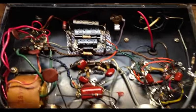Well, as happens so often whenever you're designing a one-off like this, I tested this thing out briefly and noticed that when I cranked the volume, I was getting some treble spikes on the output, just unnatural sounding spikiness. So what I've done is I've come in here and put in what's called a Zobel network here. And this is the same design that you'll find in a Hammond AO35. I've taken a few cues as I've gone along from a Hammond AO35.